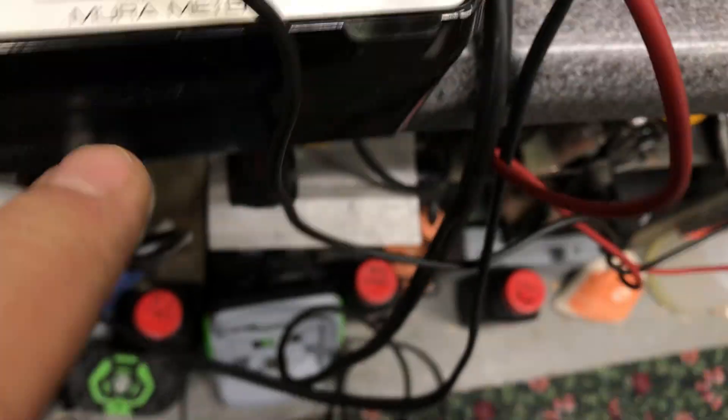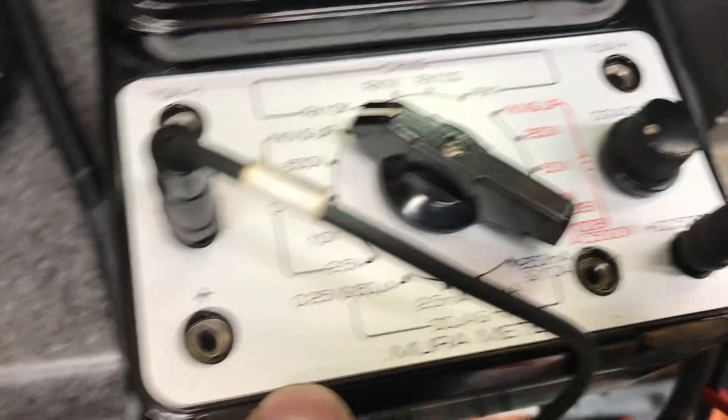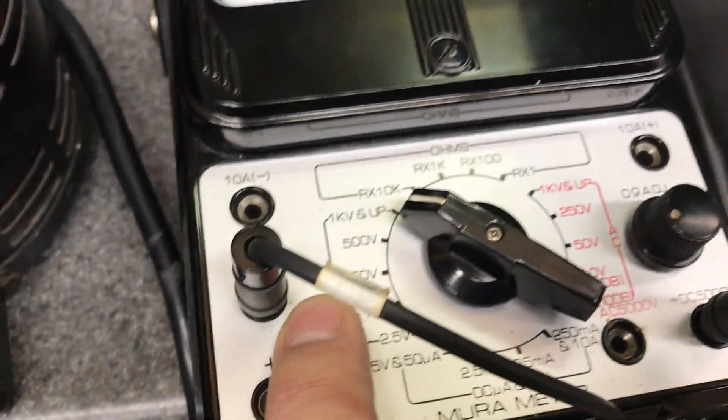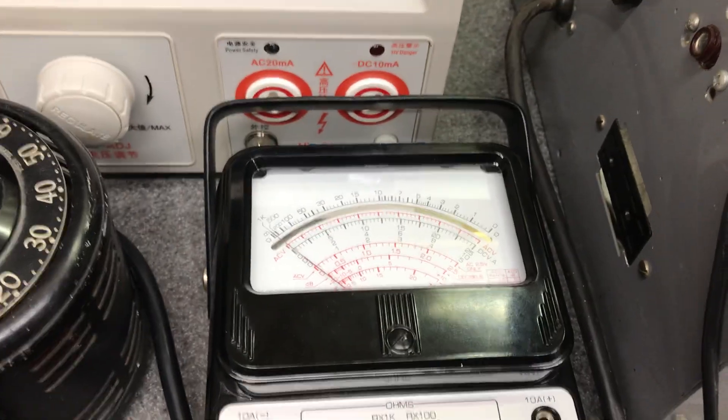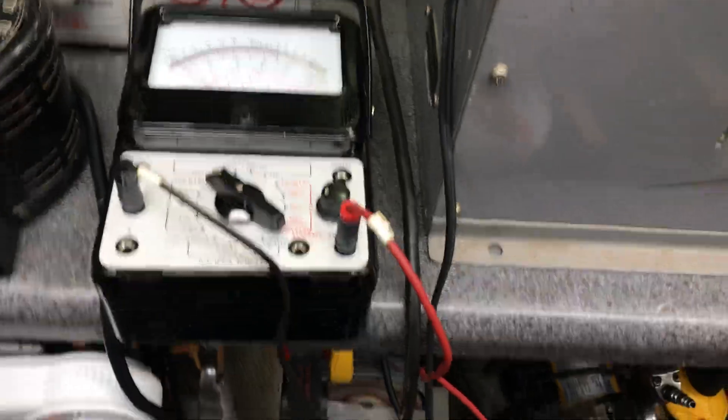Very carefully, I dummied the replacement cap in and got it on the old trusty Variac with my meter. I had some arcing-over problems — it would arc over to a stupid aluminum faceplate and arc back. That scared the bejesus out of me last night on AC. So I insulated that and put it on DC 5000 volts. With the Variac, I brought it up real slow, and it actually worked.